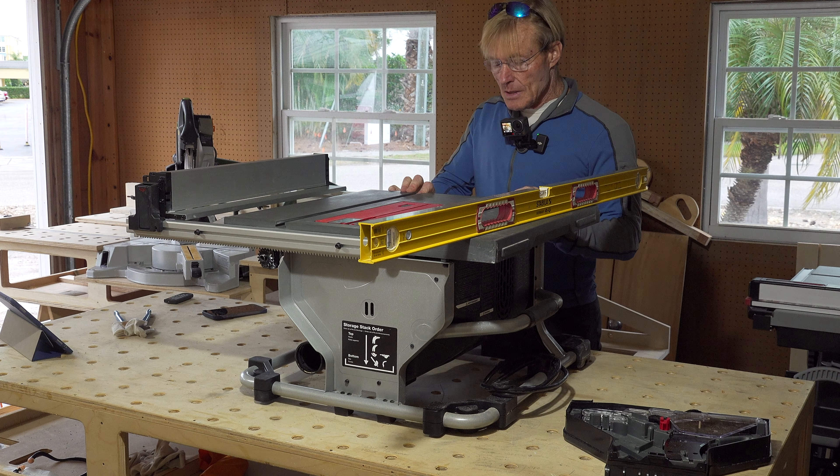I'm holding it in place with my finger as tight as it'll go. That cuts out about two thirds of the movement. The thing I want to be careful about is if I go too far, it's going to be too snug for this to move smoothly. The only way to really know is to tighten it up. It's a little snug, but this feels good — even without the lock on, if I get it to a position it's going to stay where I stop turning it before I lock it. Now you know: with that puck adjustment and guide rail adjustment, you can make sure that your fence support is perfectly aligned and yet still operates smoothly.